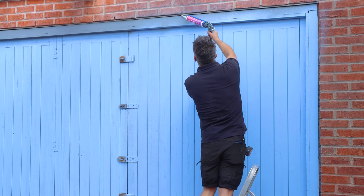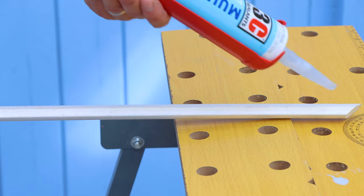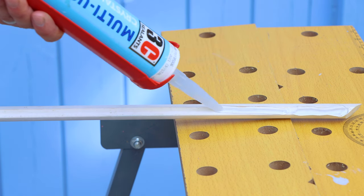If you've got larger gaps like this side, you can always fill them first with an expanding foam. Let that dry and then it can be covered. Around the top and the two sides of the frame, I'm going to be covering the gaps with a plastic PVC bead.